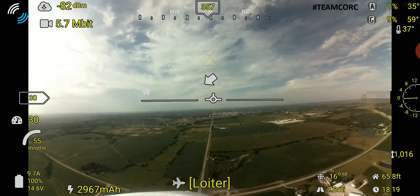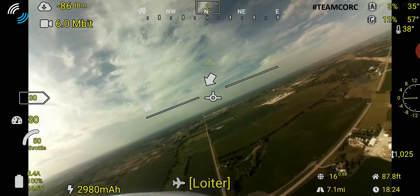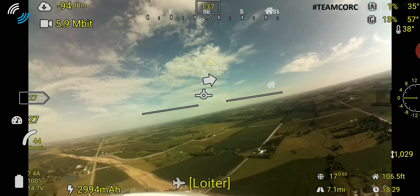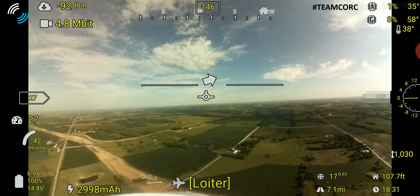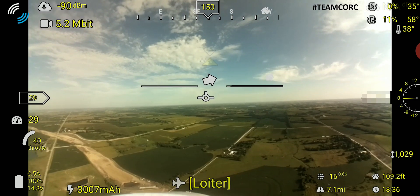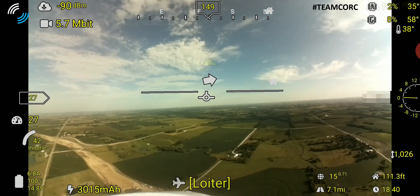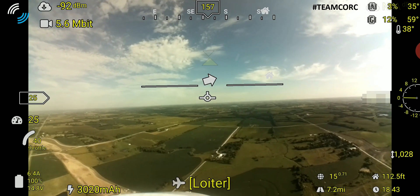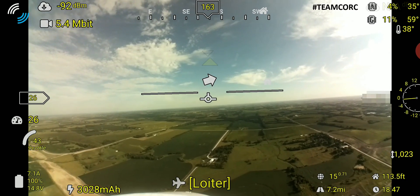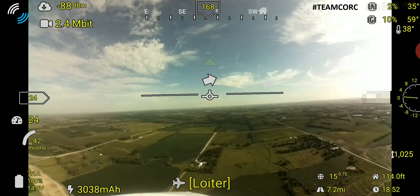I just can't say enough about how impressed I am with the OpenHD system. Using a couple of old Pis, some old WiFi cards, and a very inexpensive Pi camera with a $12 lens added to it, and you get HD quality footage. It's tough to go back to analog. I'm still working out the bugs with this system and I'd really like to get more range, but just the limited amount of cost you have to put in to get a quality HD system — what this system offers is very impressive.